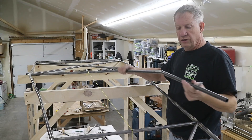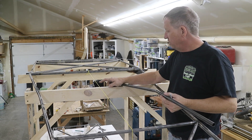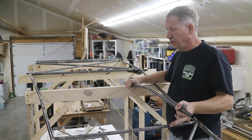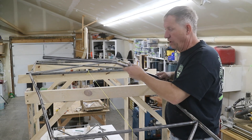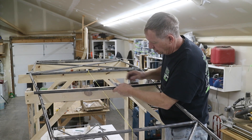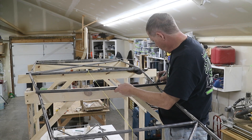I've welded that together with this peak. And I set up a centerline between these two other stations before and after M. So now I'm just going to use that to determine center where this weld goes, and kind of mark where I'm going to start.